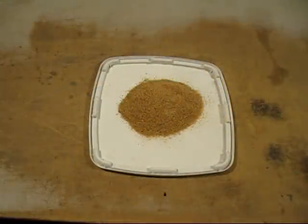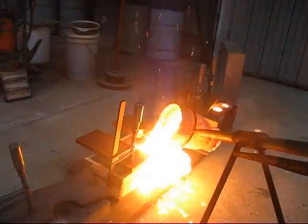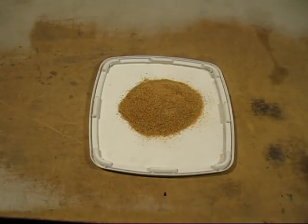If you're wondering how I came up with the idea of using sawdust as a substitute for coal dust, watch the next video clip and you'll see how I spilt iron onto a wooden plank below the molding box — it just bursts into flame. When molten iron flows over sand that contains a combustible material like coal dust or sawdust, it actually lifts or pushes the metal away from the sand. It doesn't matter if it's the cope or the drag — it pushes the molten metal away so it doesn't stick to the sand, making it easier to shake out the mold.